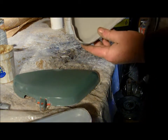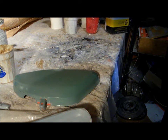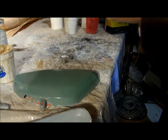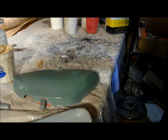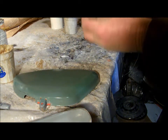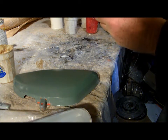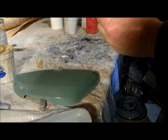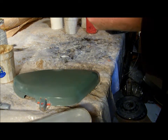This isn't a production mold — they'd usually be much thicker. Came out pretty good. I do have to do a little cleanup around where the coating came in underneath where the spot welds were, but everything else looks great. I didn't cut back enough on the fiberglass, so I got a couple of holes there — that's between the coating and the fiberglass. Not a big deal. All I'm going to do is fill that with super glue, hit it with a kicker, and that's going to harden up and not be a problem at all.